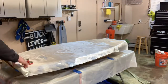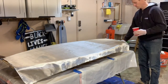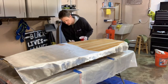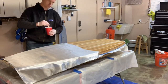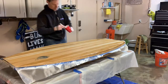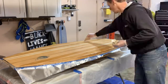The process for glassing the deck is the same as glassing the hull, taking care not to get epoxy dripping onto the hull underneath. You're going to want to pay attention to what kind of epoxy you're using and what kind of hardener you're mixing with it based on the conditions in your shop. I'm using West Systems epoxy with the 207 clear hardener because it dries completely clear so you get the full effect of the wood.